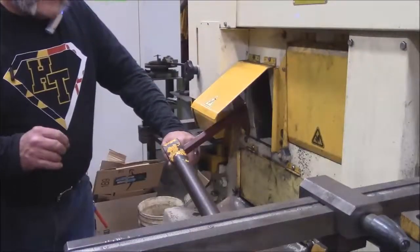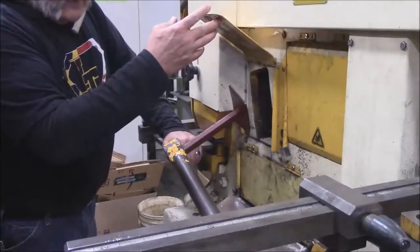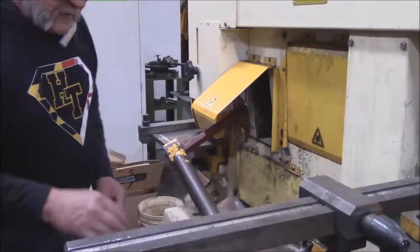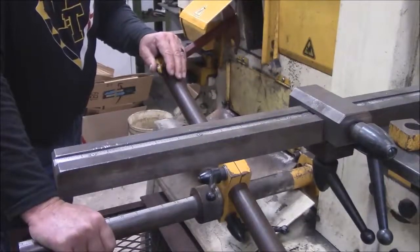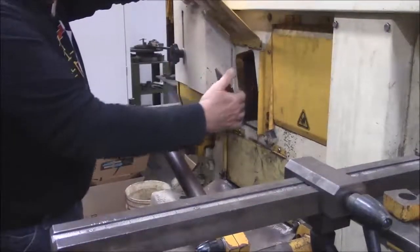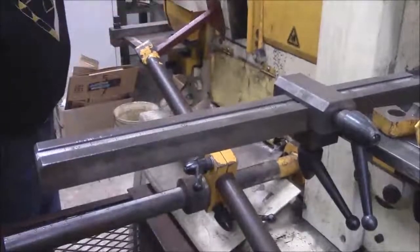On the back side of the machine, these are guards. When the metal comes through, this guard will come up and out of the way, so you've got to be careful when operating this machine that your hands aren't anywhere near the guards. This right here gives you the chance to do your multiple cuts. The shear actually comes and cuts along the piece here and also underneath, so all these places the shear comes through and cuts it right off.